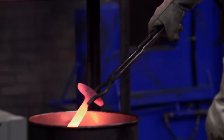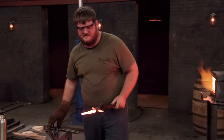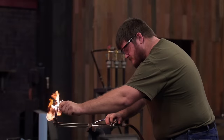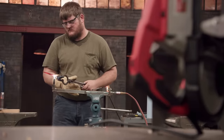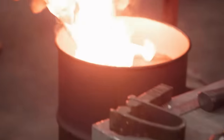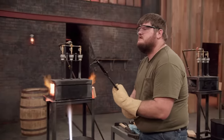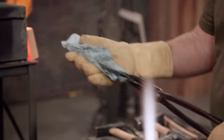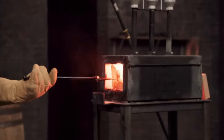I'm a little worried about the heat treat, because I'm going with an unfamiliar steel, unfamiliar forge that's running hot. And I'm most worried about the hardness of the tips. That's way hotter than it needs to be. I don't want to quench too hot — it might cause it to break. So I use the cutting torch. I carefully take my time, heat it up evenly, and quench it. James just quenched — fireball right in the face. I go to quench my second blade and get a warp. This is bad. James has a warp that he is just fighting right now. I have to straighten that out, try it again. I got another warp. I almost never have warps. If I can't get my warp straightened all the way, it could bite me.